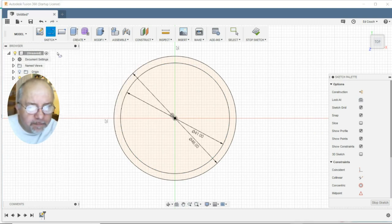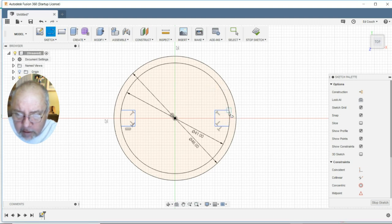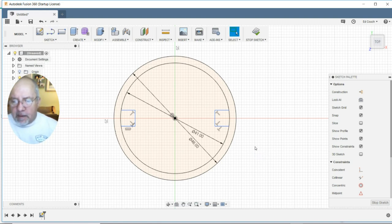Now we need to create the locking lugs again. We are going to do that by going back about 5 and a quarter, over 6 and back to the rank — same thing on the other side. Now we have got a ring and we have got our lugs to lock it into the T-slots, which will prevent the display from sliding forward or backwards.